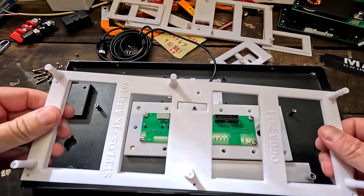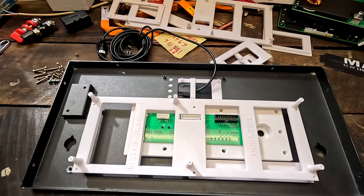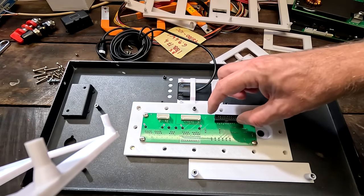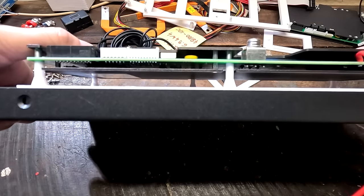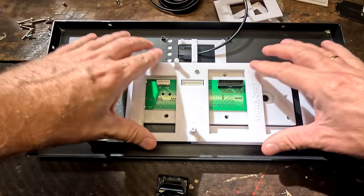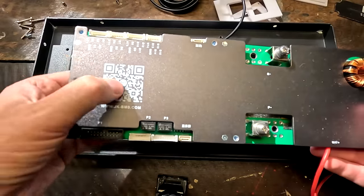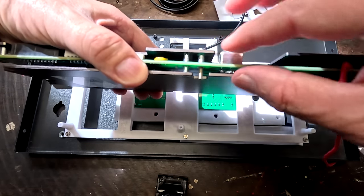Now the adapted and modified JK carrier has a cutout for the middle contact and sits on top of all that. I had to modify these standoffs — make them 8 millimeters longer — because I didn't realize the cables and plugs were so outstanding that the BMS didn't fit on top anymore. Now this design gives us enough space for the cables and connectors underneath, and I've also made these nipples a lot stronger. I've put the carrier in place — it's holding down the cover for the old communication cutouts. We've got the JK 100A BMS here — put it in place and use M3 by 20mm screws into the standoffs.